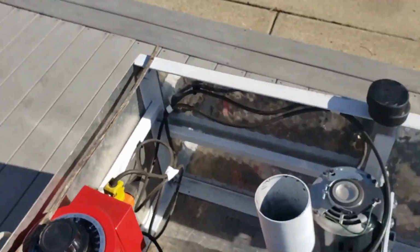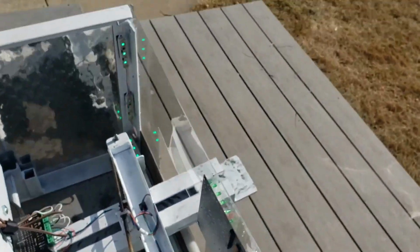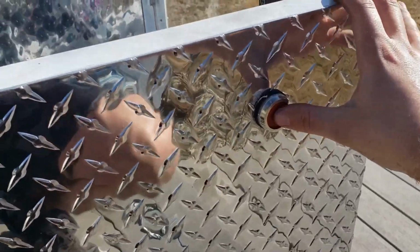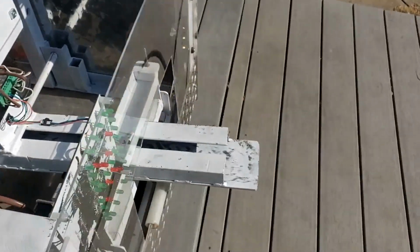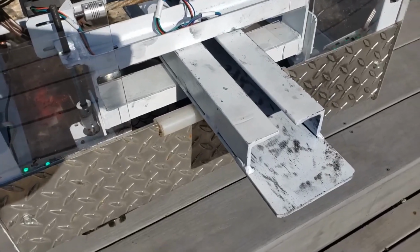The machine can easily, once a puck is dropped back in, will know the machine is ready to go and activate as soon as the start button is pushed again. When the stop button is pushed, it will return the machine back to its standby state by stopping the shooting of pucks, as well as returning the aiming mechanism back to its original starting storage location.